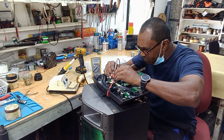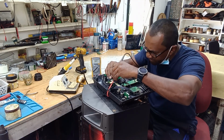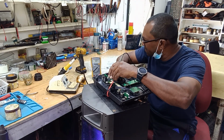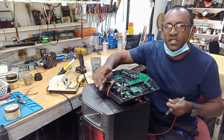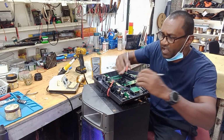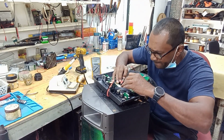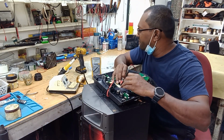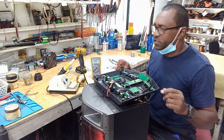It's a ground with 2 voltages, 1 plus and 1 minus. I'm getting plus 8.505 volts, and I'm getting minus 7.94 volts. Now the other cable, this is the one that, according to the board here, says 5 volts. So I have to check to see if I'm getting 5 volts here. I'm only getting 1.34 volts. Okay? So I'm not getting the 5 volts.